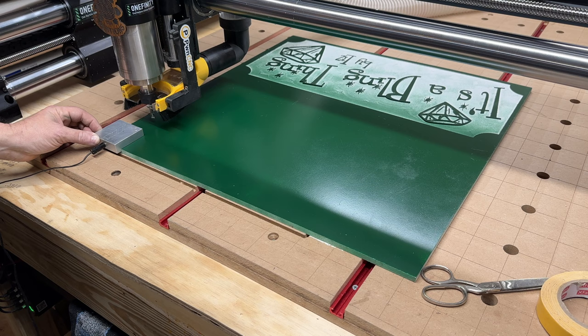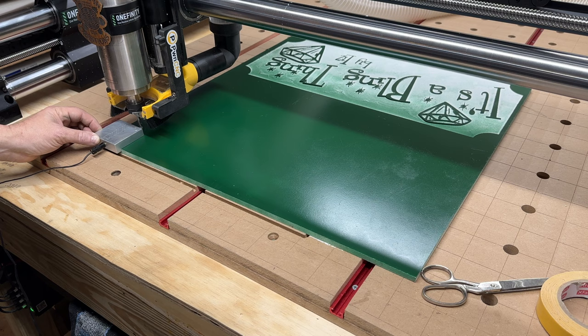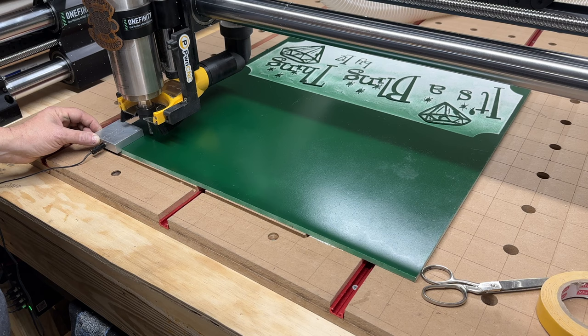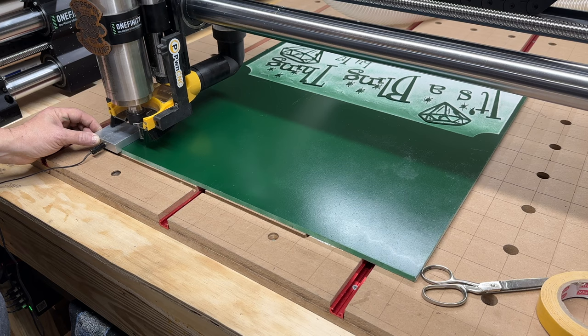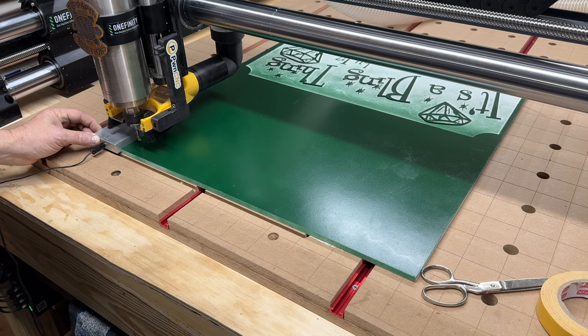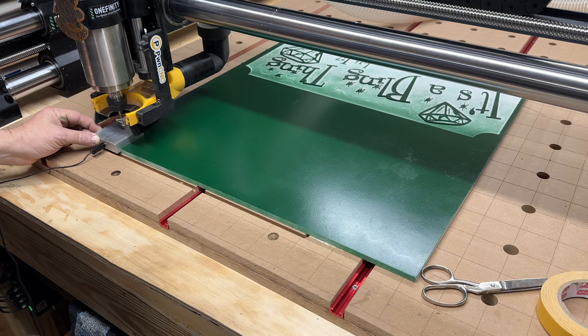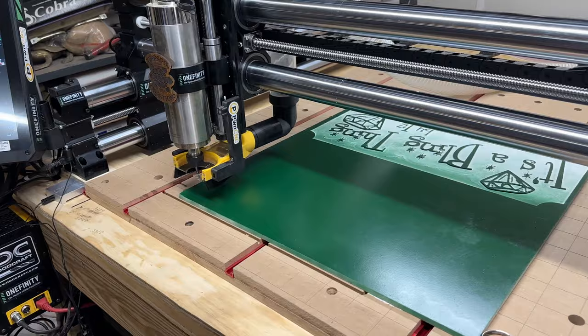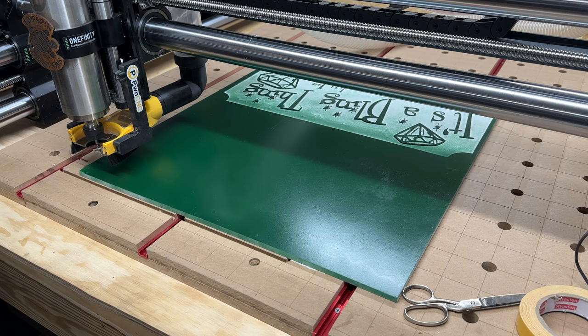Go to my probing screen again, top right corner. I'm just gonna come over here, round the outside. Come on. There we go. Beep. The up, the over. Move it over there, touch the middle, and it's going to probe that. Beep. Okay, so now my X, Y, and Z are probed. I should be good to go. So let's see what happens. Exiting the probing screen, going back to the program MDI screen.